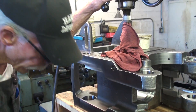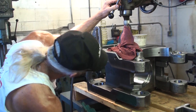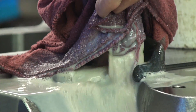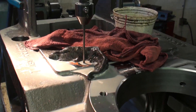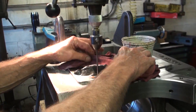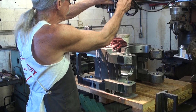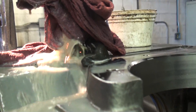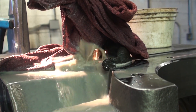What I'll do now is make one burn. Turn the machine off — you always double check your center. Which is perfect. So at this point we wrap it back up and continue burning. I'll show you a little bit of the arcing that's going on — that's burning a hole through the tap.